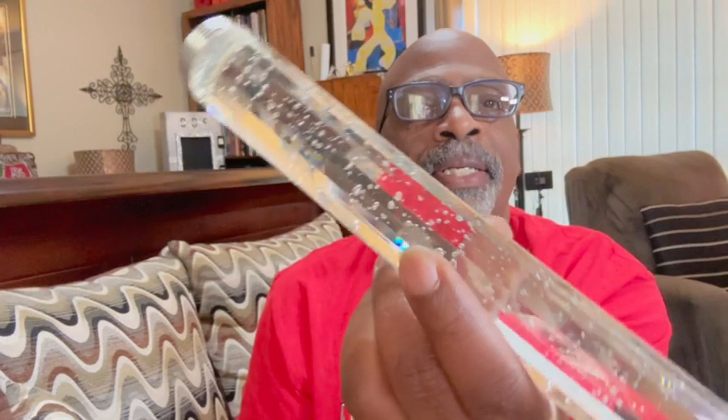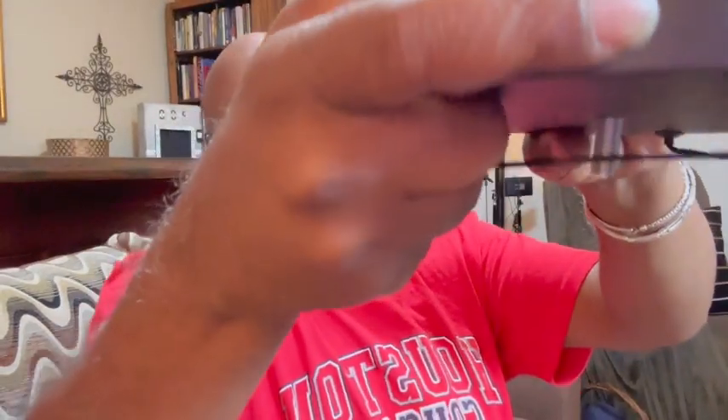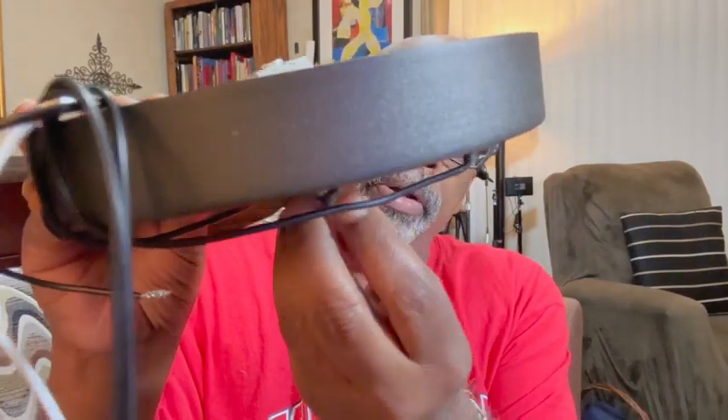Before you get started, you need to really know how this is going to work. From the diagram, it looks like this particular item will go into the junction box like so — you have two screws that will go there, and it does come with screws in your little packet for your junction box. You can usually use the screws already there, but in my case I'm replacing a fluorescent, so I'll be using the included screws to mount up to the junction box. Then you take your light and the screw goes through like so, with a finished nut that goes on the screw to connect everything.